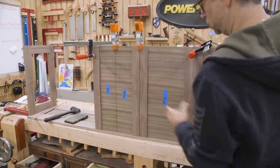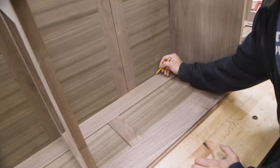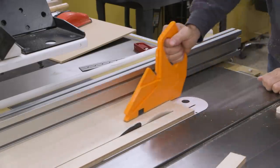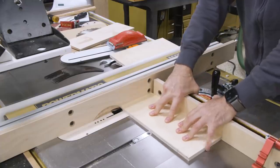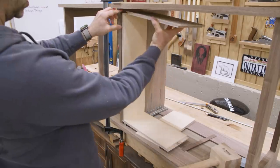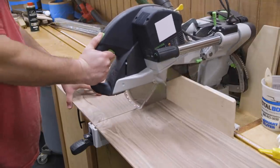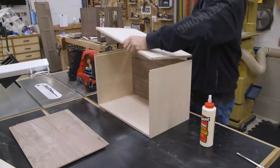Now I need to know exactly where to install my drawer slides and I'll get that info from the drawer fronts. If I know where my fronts sit in relation to my future drawer boxes, I can make the marks and measurements that allow me to construct a set of spacers — which I failed to film, but you'll see them in use later. So now we need to make some drawer boxes. I cut my rabbets in the drawer sides and then cut the fronts and backs to their final length based on the fit that I see in the actual case. Of course each drawer needs a bottom, so we'll cut a groove and then cut some quarter-inch stock for the bottom panels. Glue up time! I'll reinforce the rabbets with some 18-gauge brad nails.